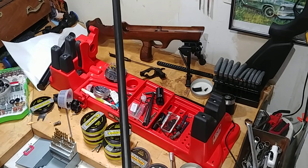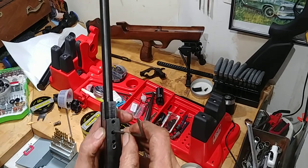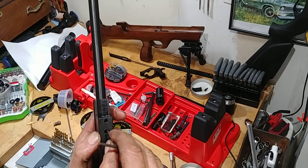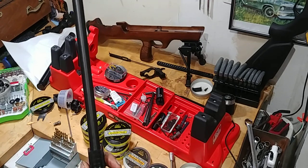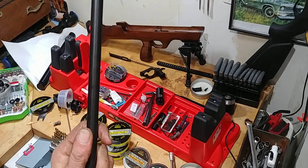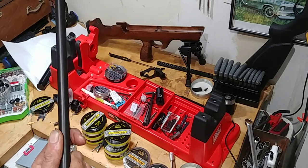What I use is a 195 thousandths. It'll be in the bridge port, and I'll switch it over to 160 thousandths so I know my drill bit is centered, and I will just go down through. And once that is done, I will be able to clean this all out, chamfer this.